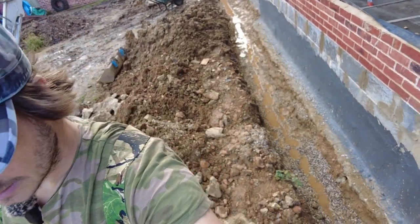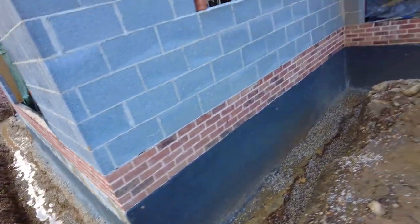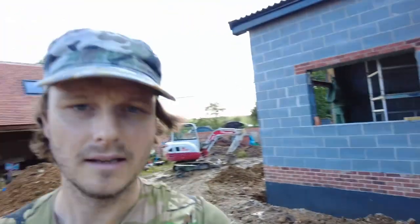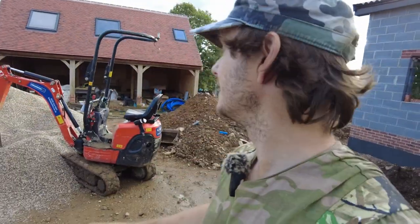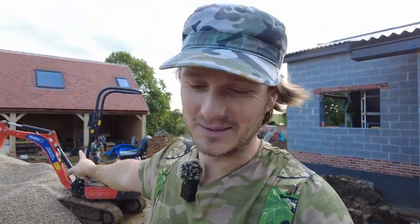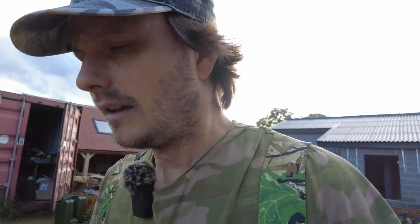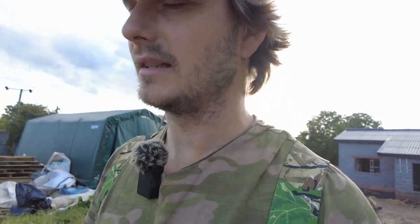Right, that's all gravelled up, I'm kind of graded, you see it. Most of the water's already come out. The pipe got blocked with a load of silt, so we had to try and sort that out. I'm going to buy a jetting kit and do it later properly, but it's about a third blocked, I'd say.